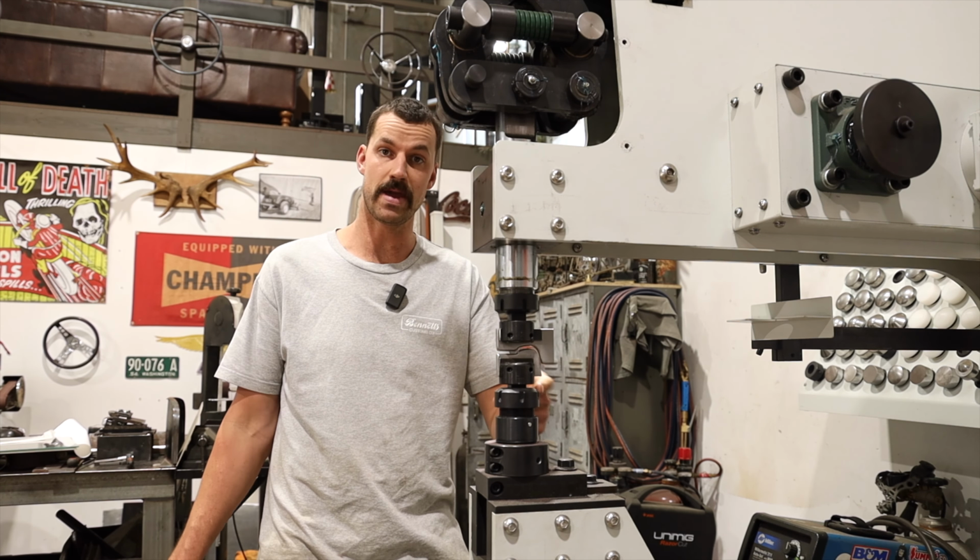And what I did was I took the lower stepping die out of the kit and I've just rounded the edge off. And then I've brought this tipping die closer up every time, tried different pressures, and was able to get a really nice profile. This is kind of it. So rather than this was kind of the first one where it's quite a noticeable step. There's a hard edge here and a hard edge here. Whereas we want to have a hard edge on the inside and then kind of have it roll. So you can actually see how it's sort of rolled out.